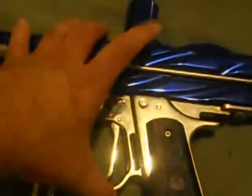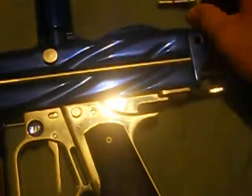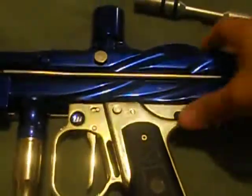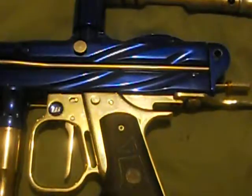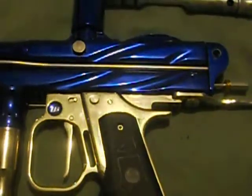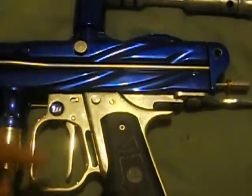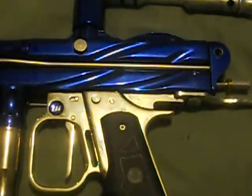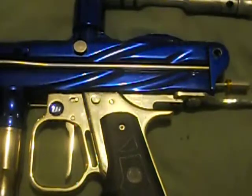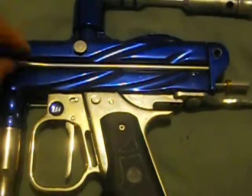The way you adjust the firing sequence is through here. Take off your bolt and pin. There's the bolt — take that out. Stick an Allen key right through that little hole. For adjusting your trigger pull, if you turn it clockwise going inward, that's going to make it shoot later — it's going to delay your shooting. If you back out that screw or turn it counterclockwise, it's going to shoot sooner or earlier in the trigger pull. It's very simple stuff, very basic.